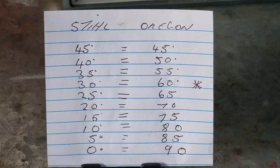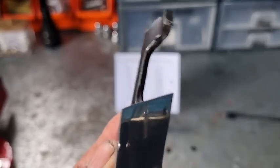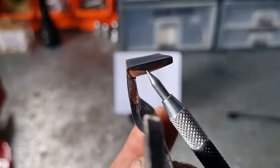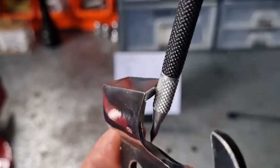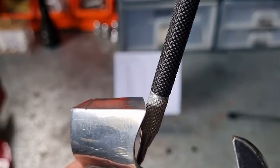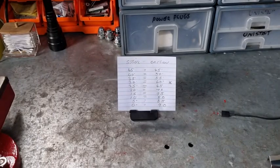The top plate angle is the actual angle of the tooth. On a full chisel chain we refer to those two angles as a compounded bevel angle. The top plate is your primary angle; your secondary angle is the face angle — the face that runs along the 30 degree angle made by a grinding wheel that comes in at 30 degrees but shows as 60 degrees because 90 degrees rotated to the right 30 degrees puts you at 60 degrees on your scale.